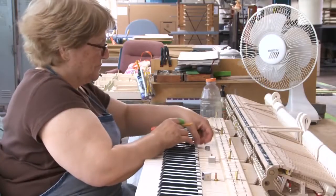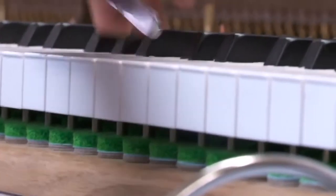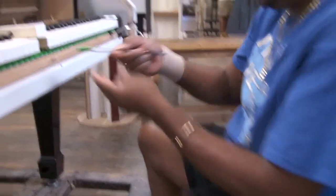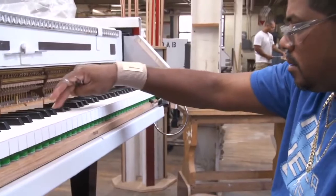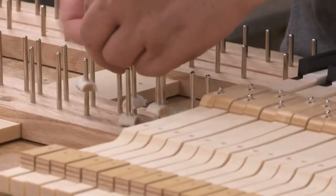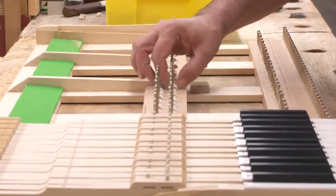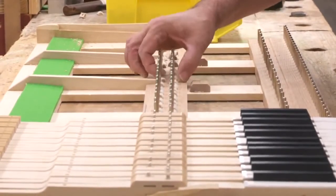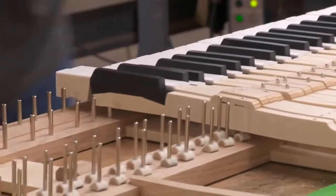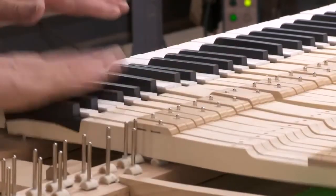Measuring the depth of keys travel is another important phase of the regulating process. Special gauges are used to measure the proper depth of touch. Key depth travel is critical. One of the main features of the grand action is those important little half-round bearings on which the keys balance. They're shaped so that the touch point where the key rests on the bearing moves backwards as the key is depressed. This allows for fast return to playing position, another Steinway patent. It's called the Steinway Accelerated Action.